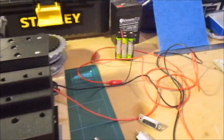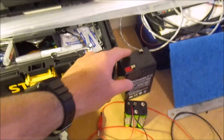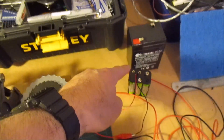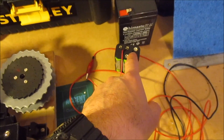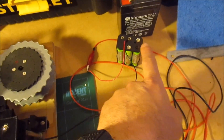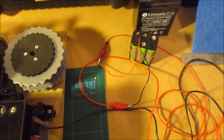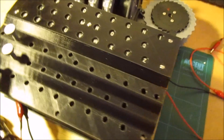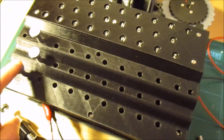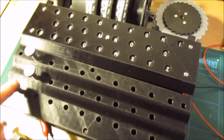I'm running them at a lower voltage. At the moment you can see here — this is actually a 6 volt sealed lead acid battery I could use. Or else what I've actually got it powered off at the moment is six double A nickel metal hydride, which gives me 7.2 volts. This is just temporarily hooked up to one of the lamps. So when we press a key, we should see one of the letters light up — and you can see there the Q lights up.